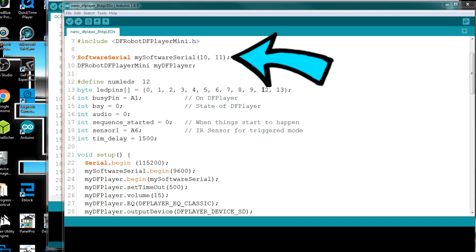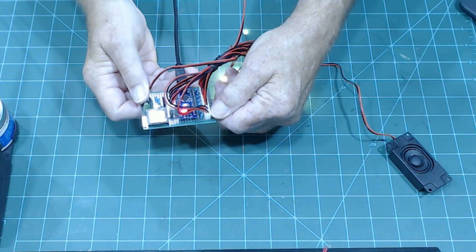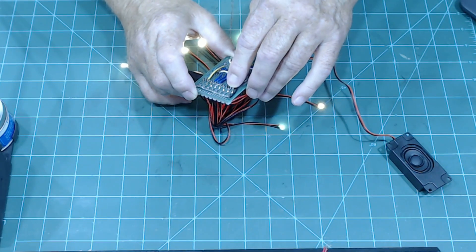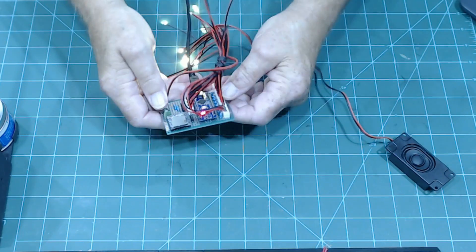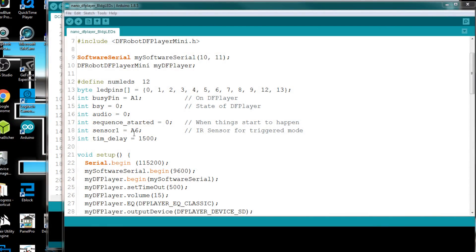What I'm going to have to do is go over and change some of this on the bottom. You can see these two right here - this is 0 and 1 - I'm going to have to cut these off and bring them over to the other side and use two of the input pins and designate those as outputs. You can see it uses pin A1 and A6. I can't use those two pins - the busy pin is used in the program so I can determine that the sound clip is being played.